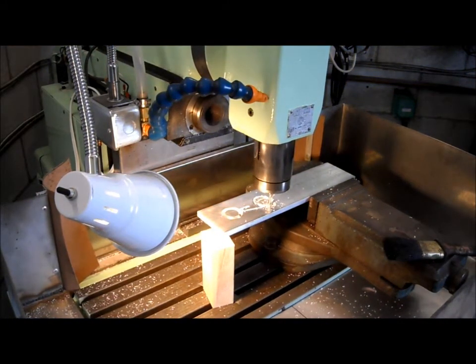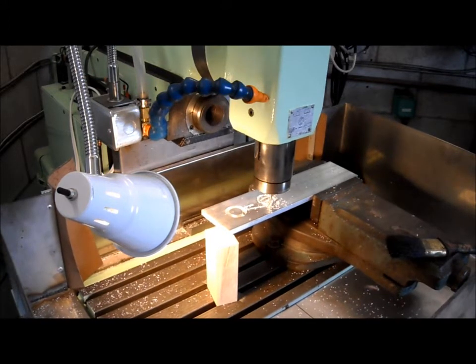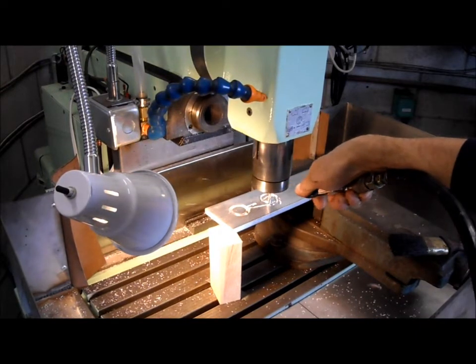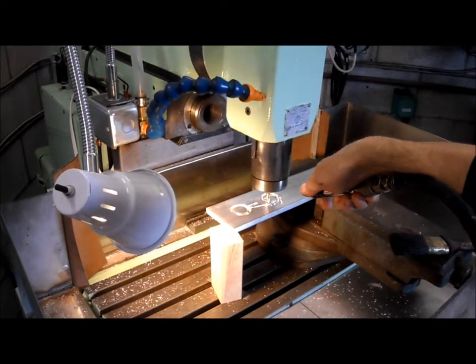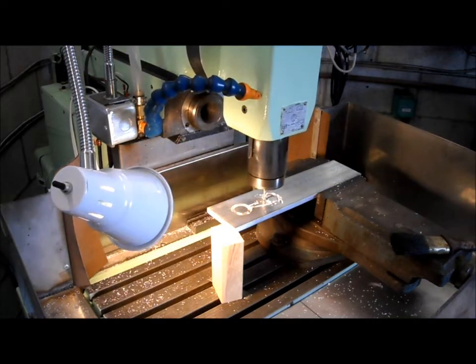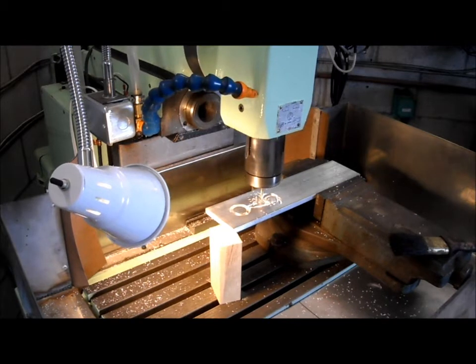The rapid, when it had to transition from the first hole to the second hole, exceeded the ability of the machine. We lost steps, and the way the Gecko drives are set up, unfortunately it resets the zero and Mach keeps going on.